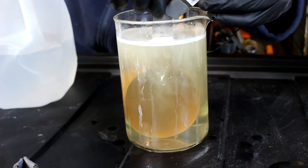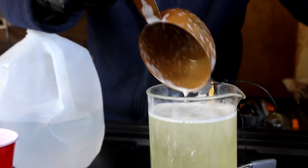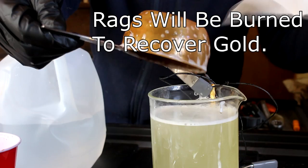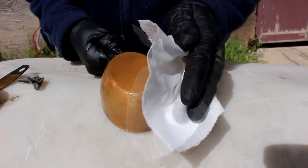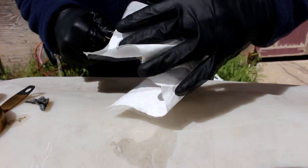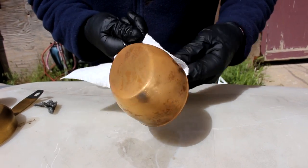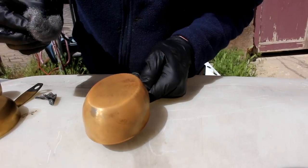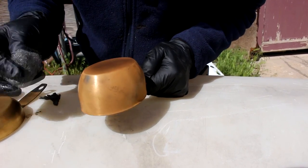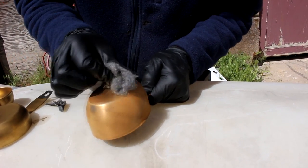Here's the big one — we just let it sit in there for about 20 minutes. Let's take this out, rinse it off, and see what else needs to happen with it. It seems like I'm going to have to dip them multiple times. They're getting shiny! I'm just going to blot this dry — it seems to do better when it's dry, like it helps the gold stick. What I've been doing is after the first dip in the electrolysis solution, just lightly rub it with some steel wool. If the gold comes off, I'll know I've got to rub that area to clean it and then dip it again.